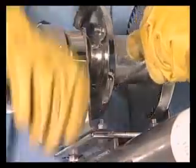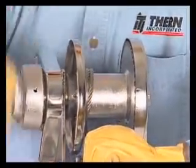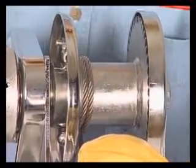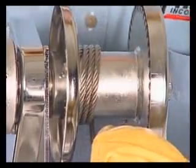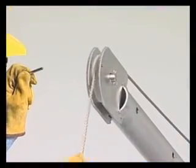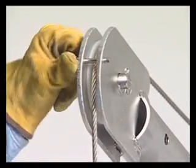This is especially useful for handling submerged mixers or pumps where the cable can be quickly attached or removed from the crane, leaving the hook head to attach to the load. Anchor the wire rope to the winch drum and wind four wraps of wire rope onto the drum. Install the pin in the end of the boom to keep the wire rope against the sheave.